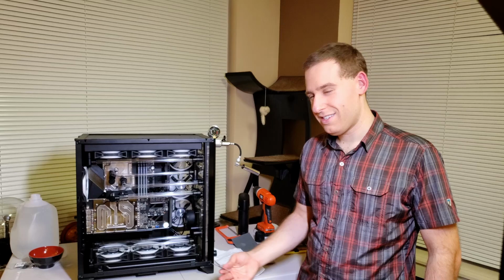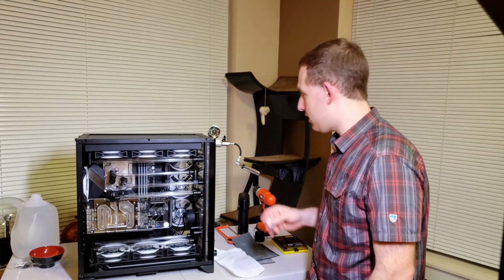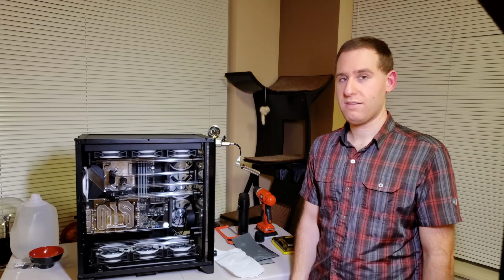I mean, it doesn't have to be perfect. You have a few millimeters of wiggle room there. As long as it's past that second O-ring, I think it's fine. I tried to take the leak tester and individually put my thumb over each end of one of these fittings and plug the other end of the leak tester and pump it up and just see if maybe there was something wrong with my fitting, the rotary piece of it or something. Nope. All four were fine.